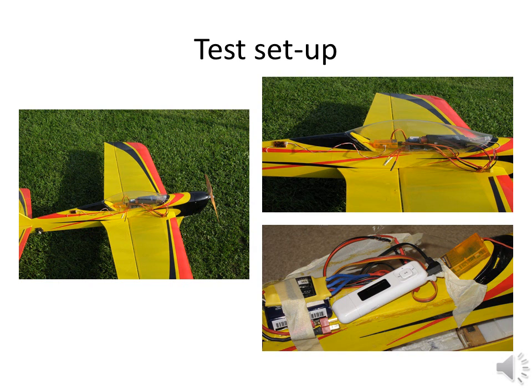I will tell more about the data logging in the next sheet, but the subject of data logging is a subject of its own and I will tell more about both measuring equipments, as well as about the special program I wrote for the evaluation of the sound recordings with the MP3 player in a separate presentation on data logging. This test setup consists of a small 2S battery, one microservo connected to the servo channel for the elevator, and the data logger itself connected to the servo channel for the rudder. The aerobatic plane is operated on 35 MHz and has not suffered nor caused any disturbances.